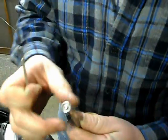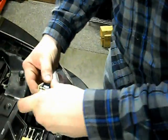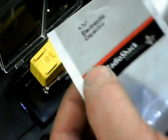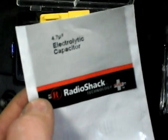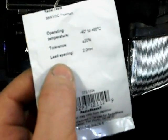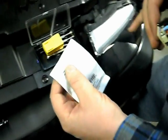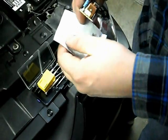It is a little bit of a process, but I didn't even need a needle nose — awesome. I already did this one; this one's already done. But this is what the inside of your flasher looks like. Go to Radio Shack and get yourself a 4.7 uF capacitor — about a dollar fifty. Make sure the spacing is correct in millimeters; the tolerance is plus 20%, operating temperature is negative 40 degrees to 85 degrees Celsius.